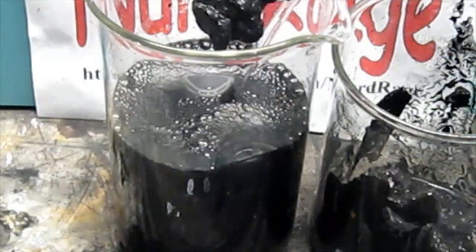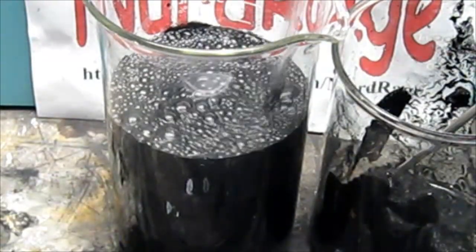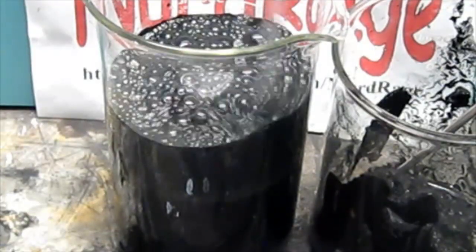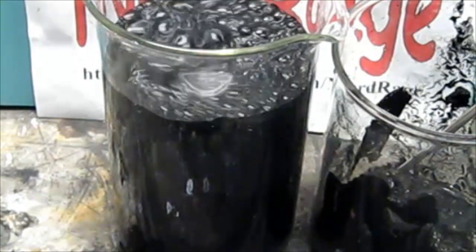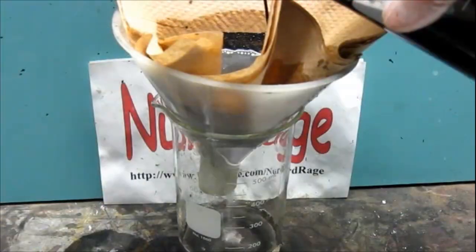It's impossible to say exactly how much paste you'll need because all batteries are different and the state of charge before opening also has an effect — just keep going until it stops fizzing. For the amount of acids in this video I needed about 100 g of battery paste. Once it's finished, just filter it through.